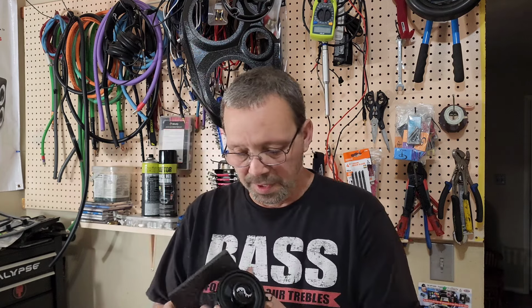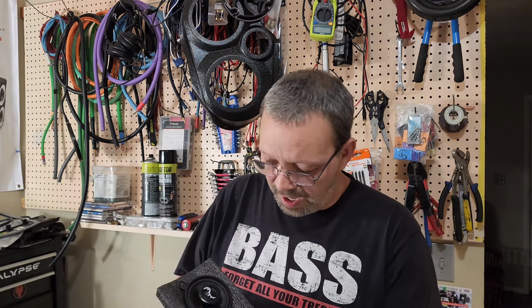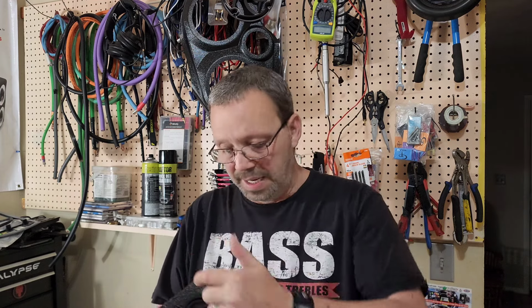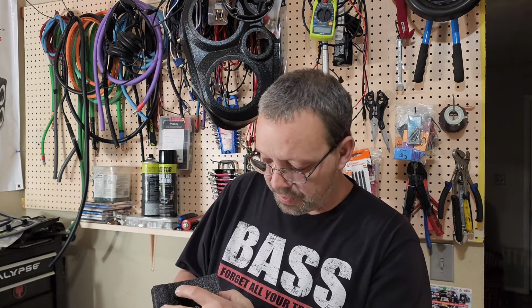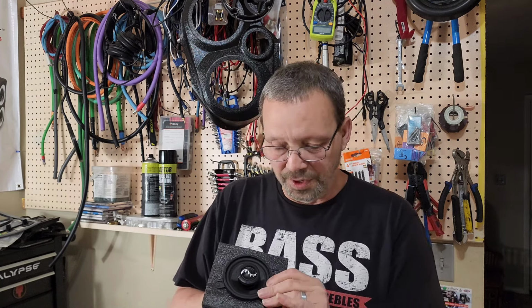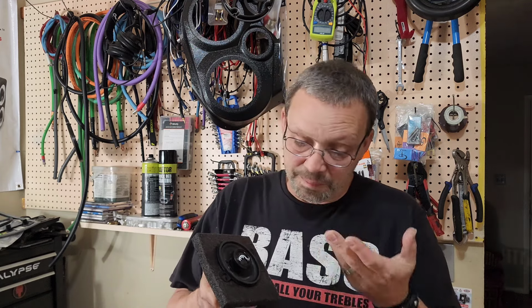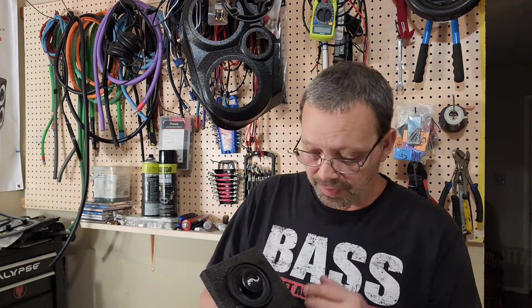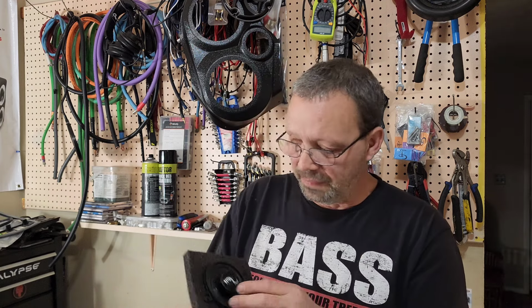Now you add this little ring here, and all of a sudden, those notes have to go a lot further to get to the back. And so you're able to play and reproduce the notes that make it to the edge of this baffle, right? So now you've lowered the cutoff point of your high-pass filter, essentially. And it pretty much works exactly like a high-pass filter. It allows highs to continue, and by physics, cancels out the lows that are lower than the size of this baffle.